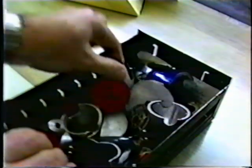What I did here is I anodized the spinner first. Anodizing makes a good bond for paint. Then I've used one thin coat of auto primer, and then I've used the lacquer, and here you can even see the clear peeling right off. You can almost see it coming off. If you don't anodize, second choice is, we probably have one of them spinners here too. Of course, you can always chrome plate, that's another way. And the chrome plating usually peels off if it's aluminum.